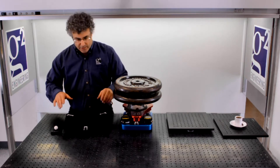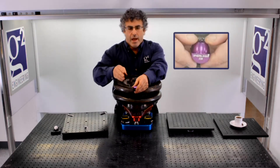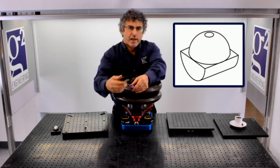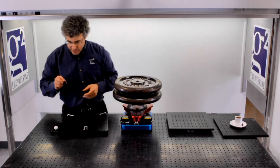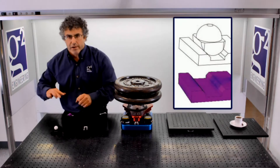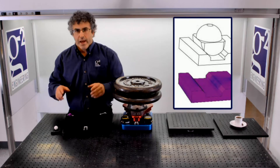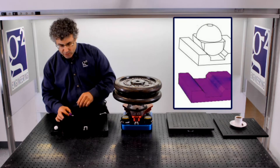To fix that, we're introducing a solid body that is half of a cylinder and half of a sphere. We call it the spherolinder, and it has the property that the center of the sphere lies on the axis of the cylinder. Once we place the spherolinder in the V-groove, it touches the walls of the V-groove along two parallel lines, distributing the load. This already increases load capacity by two orders of magnitude — a hundredfold. In addition, these contact lines are parallel to the direction of motion, so they reduce the resistance against motion of the spherolinder within the V-groove.